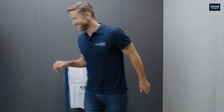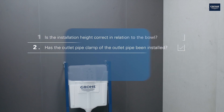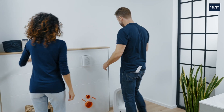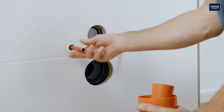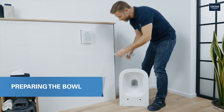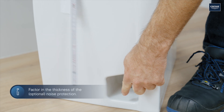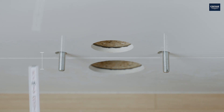Now let's check that we've dealt with all the important aspects. Afterwards, the frame has to be covered to the bare wall protection with zero tolerance. Now that the unit has been covered, let's finish up the installation. You can remove the bare wall protection now to install the WC. Before mounting the WC, the retaining rods are screwed in or out to the required length — measure the WC's wall thickness and add 15–18mm to this.